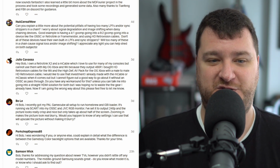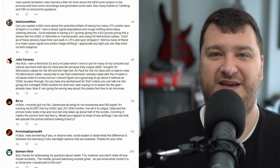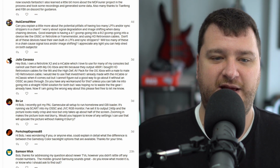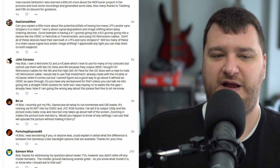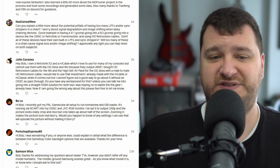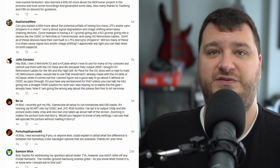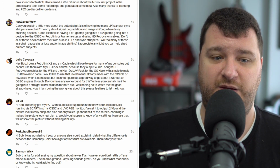And if you don't believe me, just try plugging a console directly into the OSSC onto a 4K TV and then toggle that filter off and on. You'll get exactly what I mean by that. The only issue is if you have too many, it gets to be noticeably softer. So from a safety point of view, as long as all the circuits are built right, you could have 20 low-pass filters in a row, and it's not going to hurt your equipment. You're just going to have a really soft image.